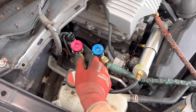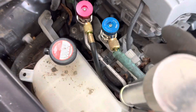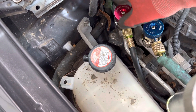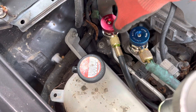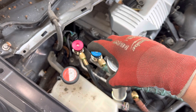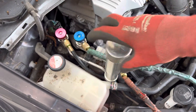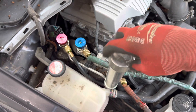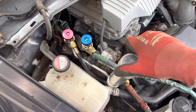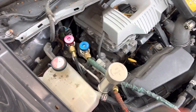I'm going to make a mess with green stuff on my fingers because I didn't bring my rag. We've got our 40 milliliters of ND11 — close this back down. See, I didn't even tighten it with force, just finger-tight. You don't want to put any force on these or you'll damage the Schrader valves inside. Now I'm screwing this down and pushing 40 milliliters of ND11 in. I also have about two to two-and-a-half milliliters of UV dye — very little, because this is a tiny system and you don't need a full 5 milliliters of concentrated dye.